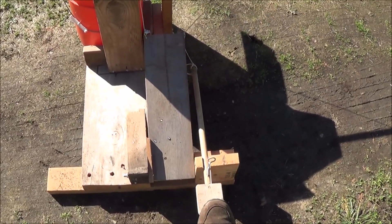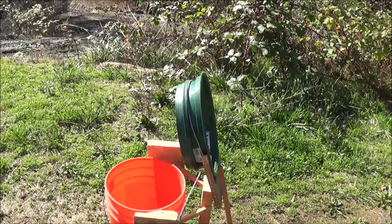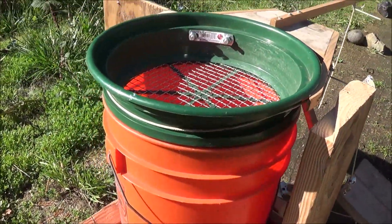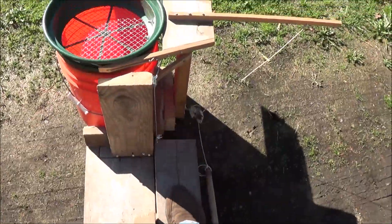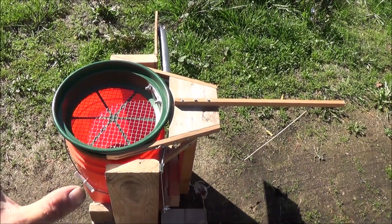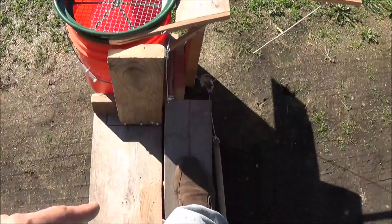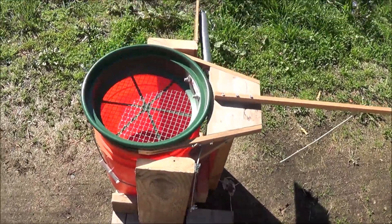The neatest thing about this is when I'm ready to dump the rocks out — you see this pedal right there — I put my foot on it and push down, and it catapults the rocks out of the screen. Anything left over catapults out, then you let go and it drops immediately right back down in line with the bucket. With the sales model we give you three different springs: a high tension spring for heavier material and bigger rocks at faster speed, a medium weight spring, and a lightweight spring for sands and gravels if you don't need as much tension.